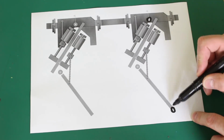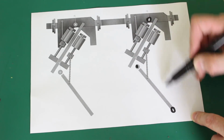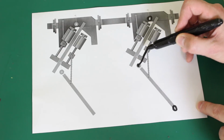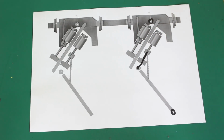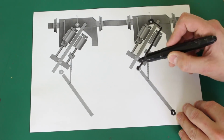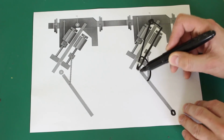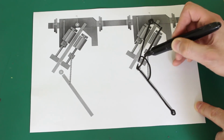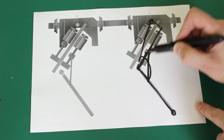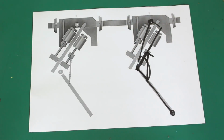So basically that makes a sort of big triangle there with that joint right there. So the thing I want to do is put in the leg length, and what I want to get out is that actuator distance. So we need to divide this into triangles to work everything out. And the first one's actually going to be a right angle triangle here. So I can work out this angle. Then I can take that away from this angle. And then when I've got that angle, I can then use this triangle with that angle to work out the actuator length, which will be there. And that's the distance I need to drive that actuator to.